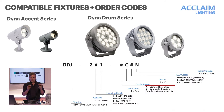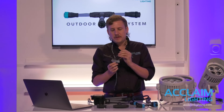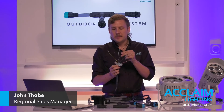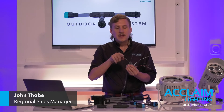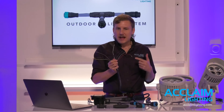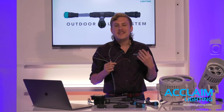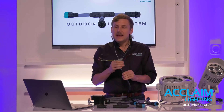Let's take a look at what this actually means for potential labor savings between connecting wires versus using the Outdoor Link System. Looking at bare wires first — this is a traditional method for any DMX-enabled fixture. Your contractor is going to be wiring AC power and DMX in and out connections in a junction box. That's three wires for power, five for DMX — eight wire splices at any given fixture. This is a typical standard.